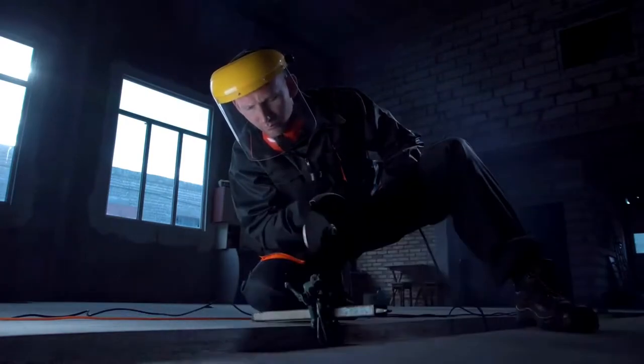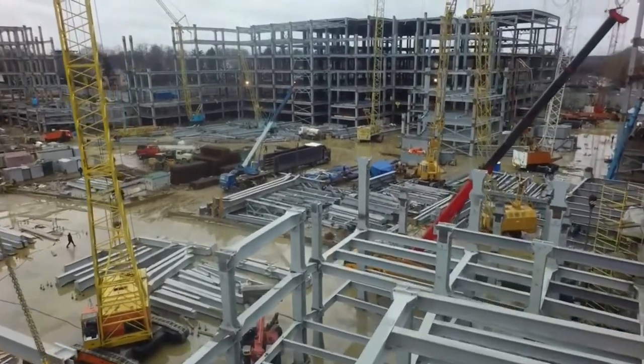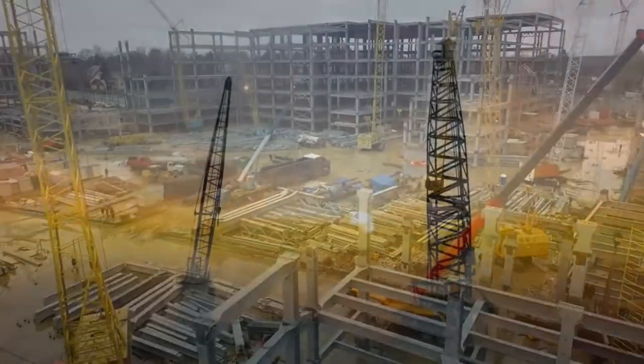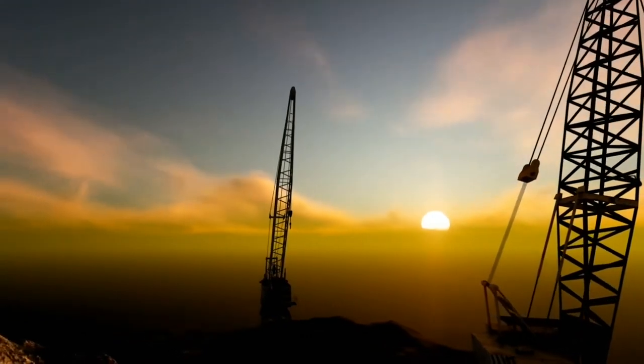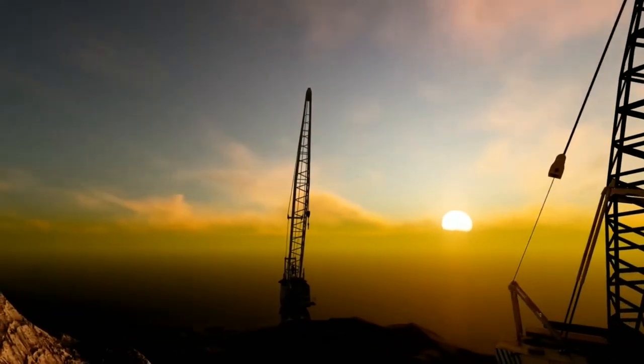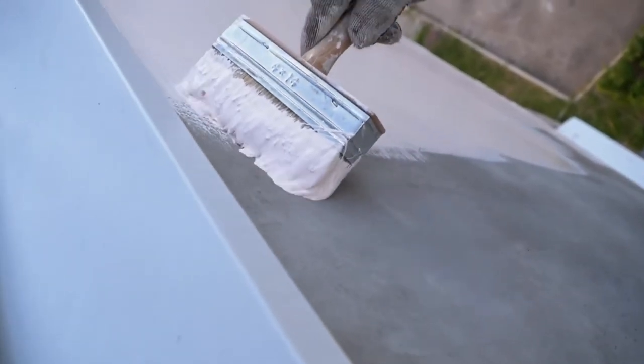The tip of the log was above the hole, and the drilling tools were suspended by a rope from the tip of the log. Other ropes were attached to the tip of the pole, and when the well drillers pulled down on these ropes, the drilling tools fell into the hole. When they released the rope, the spring of the pole lifted the tools. The spring-pole was generally anchored at an angle of about 30 degrees, but sometimes it was placed in an almost horizontal position.